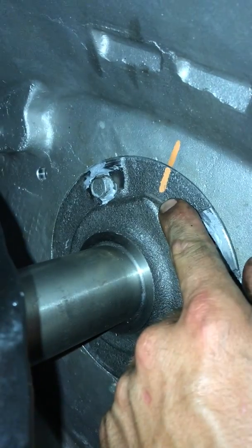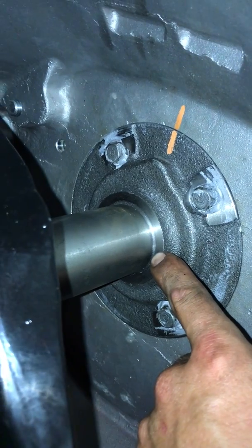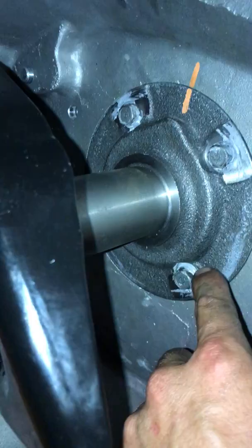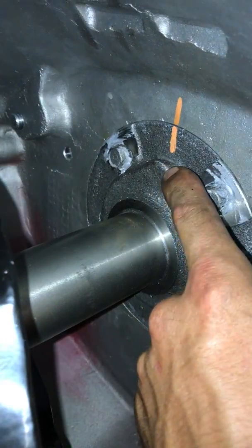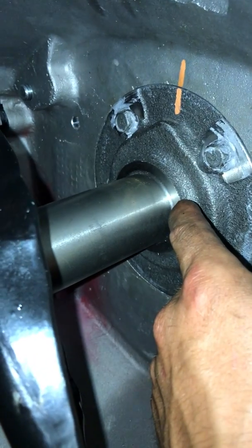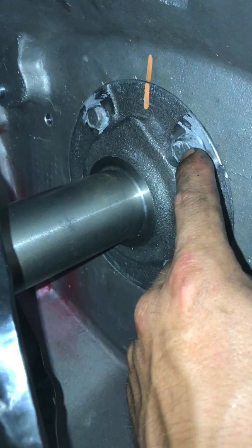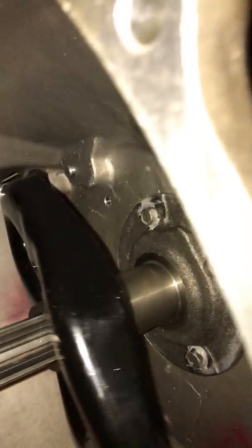As you can see, there's a top. These holes had to be matched from the old bearing retainer, and these holes are not in a square shape — this bearing retainer can only bolt in with this up. You can't bolt it 90 degrees or 180. Those holes were matched and countersunk, and the inside flange was milled down a little bit in a lathe so it fits good. Got a little play on it, but I think the pilot bearing will take it up.